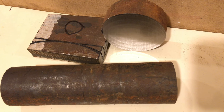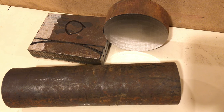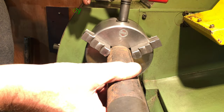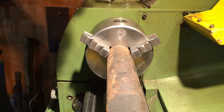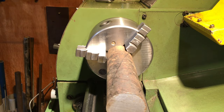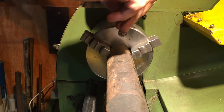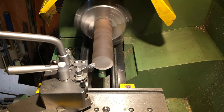In this video I show you how I made the lantern style tool post using material from an old drive shaft and some mild steel plate and bar cutoff. I've a reasonable idea of what I need to do, but I haven't any drawings beyond what I'd scribbled on the whiteboard. Most of what I did on this project was ad hoc. To start with I had an old fan drive shaft begging me to use it, so I took six inches off that and a bit of two and three quarter inch bar to make the round bits. The rest was cut from a bit of 20mm flat mild steel plate.